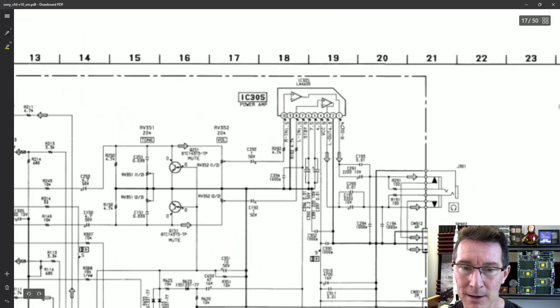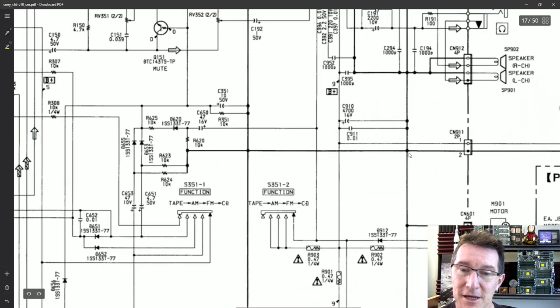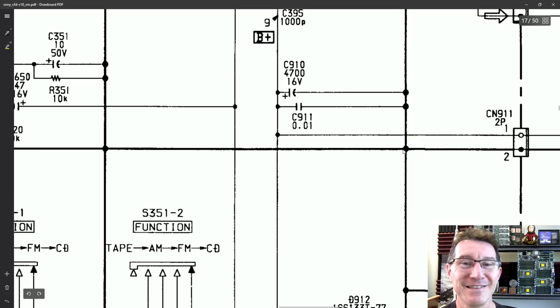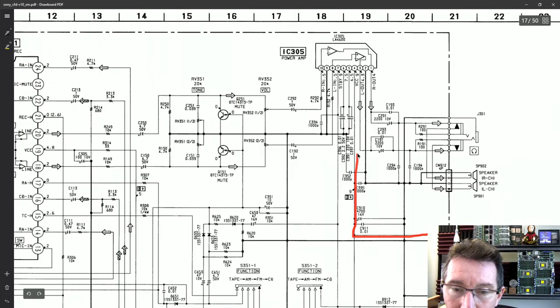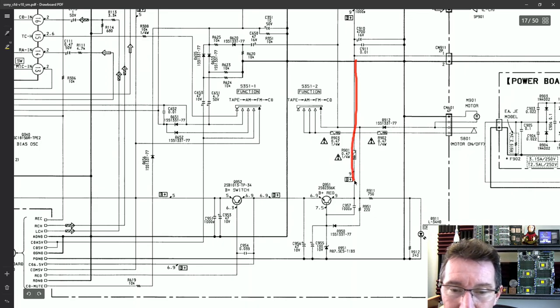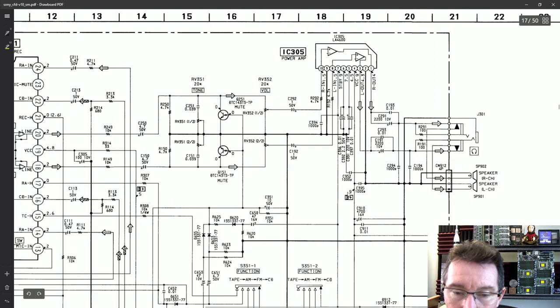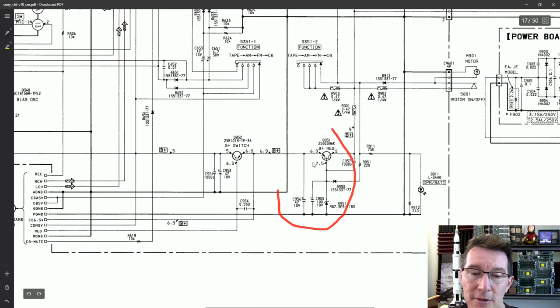We're going to come a gutter here. Here's our power amp. That's just a basic Zener reference — there's our 7.5 volt Zener. Why do we get 6.9? Well, 7.5 minus 0.6 volts drop, typically — the base-emitter drop. That gives you your 6.9 volts. The pass transistor is a 2SD2396 for those playing along at home. And you can see that bad practice over here — they've put the dot there, but you put that through a couple of facsimiles and that dot could vanish. Direct battery input here actually powers the chip directly, then that drops down via a protection resistor — a 0.47 ohm — into the regulator. They call that B+ 6.9 volts and B+ 9 volts.